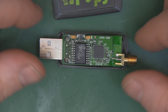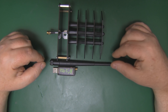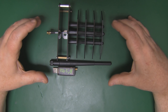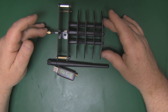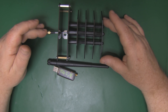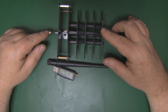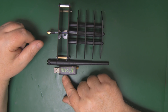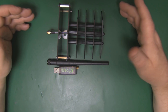To test whether the modification has actually worked, I'm going to set up a little test - scan the Wi-Fi around my lab including my neighbors' Wi-Fi using this dipole antenna, then remove the dipole and attach a bi-quad Yagi directional antenna and do the same scan again. We'll see what we pick up with the directional antenna versus the omnidirectional dipole. Because the refresh and update rate on this Wi-Spy is quite slow, I'll have to edit in between, but it should show what you can achieve using a directional antenna.